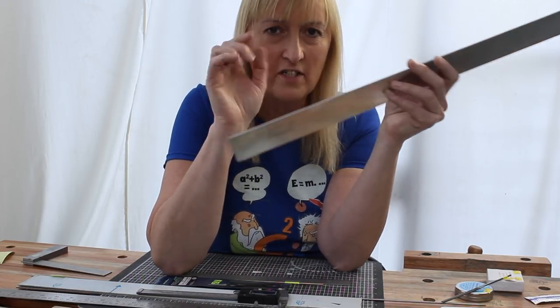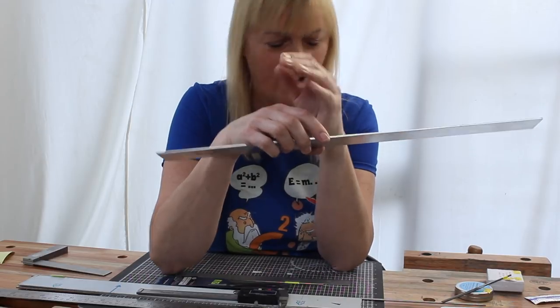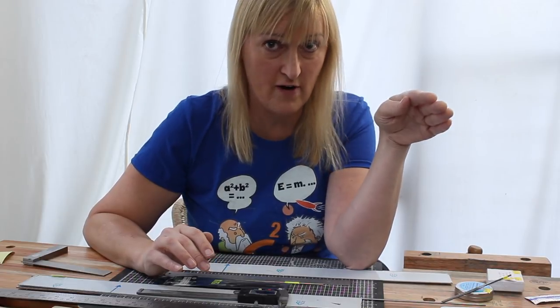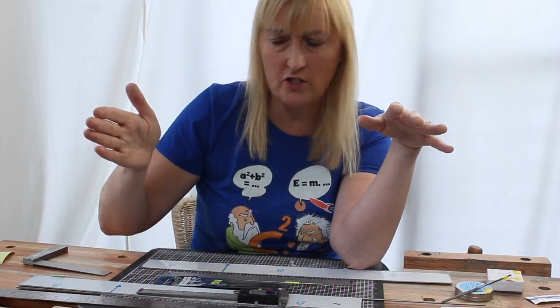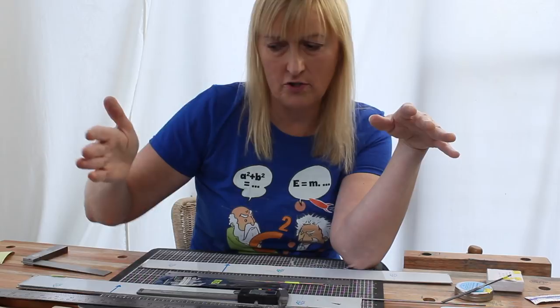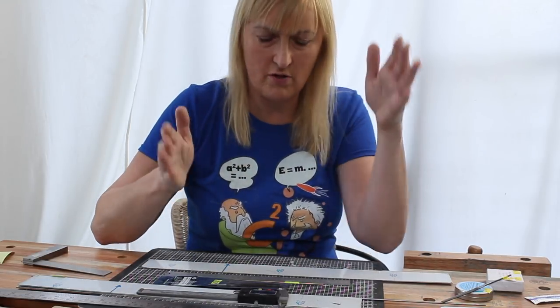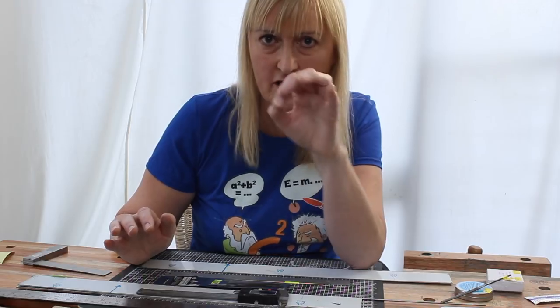To understand this, we need to consider nut compensation. Okay, so bear with me. Nut compensation. Imagine we've done a setup on a guitar, and we've done it by only considering the fretted notes. And to do this, we've put a capo across the second fret, and we've treated the 14th fret as the octave position, and we've got all the setup done, and we've adjusted the saddle, and we've got the intonation set on the saddle, and so the heavier strings, the saddle is a little bit further away, and we've got it all set up so that everything plays perfectly in tune. All the notes are the right relationship between each other. Every note we play on that fretboard, every fretted note, is exactly in tune.